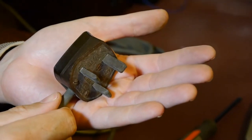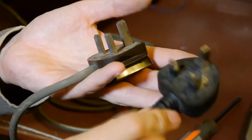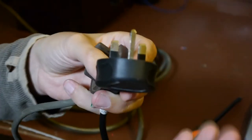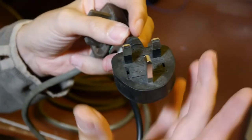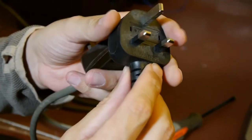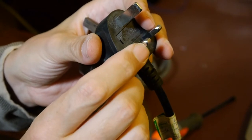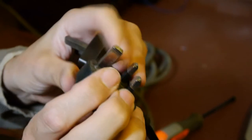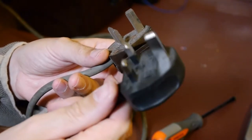The important thing about not having insulators is it actually removes all the idiots from the gene pool who do things like stick their fingers in plugs. Just as a comparison, if we look at a modern plug you've got insulators there. The purpose of them is for people who might when pulling the plug out manage to get fingers on the live terminals. The insulators mean that by the time you've created enough gap between the socket and the live prong, you'll have disconnected the plug.